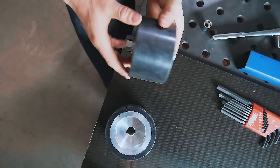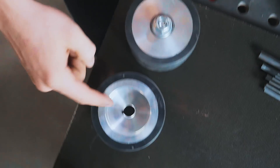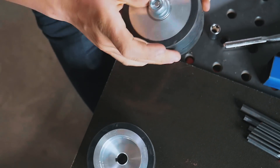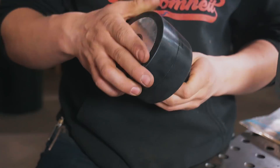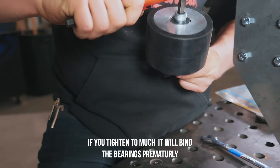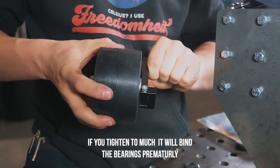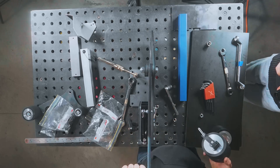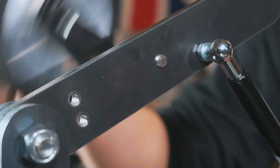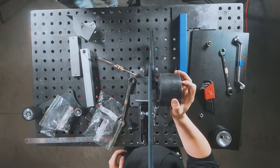Next, we take the tensioning wheel — it's a 4-inch rubberized wheel with a slight crown to the top. It's different from the drive wheel: the drive wheel has a keyway cut into it and no bearings. We'll tighten it down with the allen key; it doesn't need to be super tight, just enough that it's not wobbling side to side. Then we take the tensioning arm and thread it through that next farthest-out threaded hole until they start to rub and we're getting close.